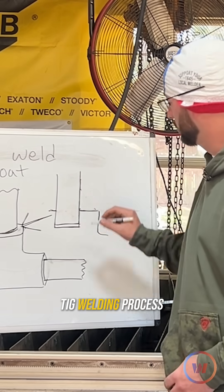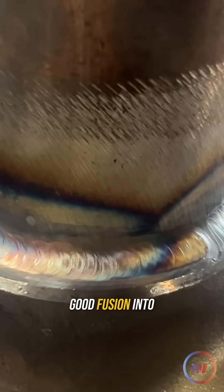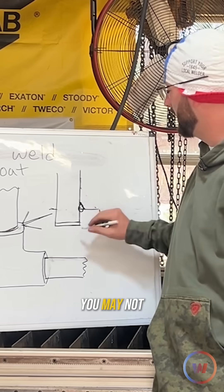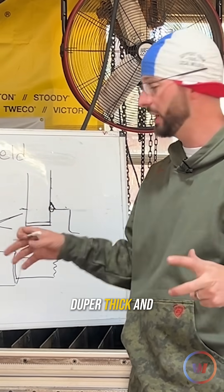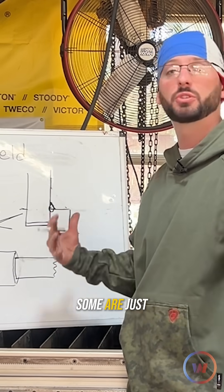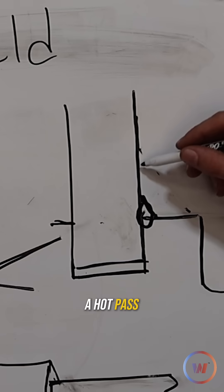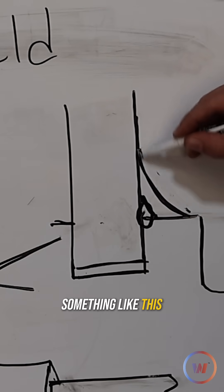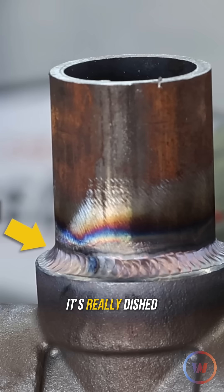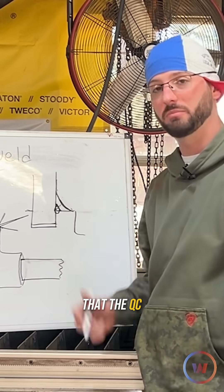What we're going to do with our TIG welding process is throw a good root pass in right here and make sure we get good fusion into it. For some socket welds, you may not need much filling. I've dealt with socket welds that are super thick and need multiple passes, and some are just single-pass welds. But most of the time, it's a root and at least a hot pass. A lot of welders will end up with something really dished out — the distance from the weld face to the root is much less, so it doesn't necessarily have the strength that QC might be looking for.